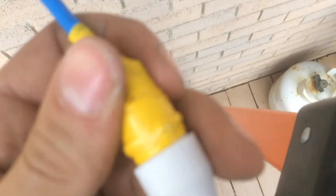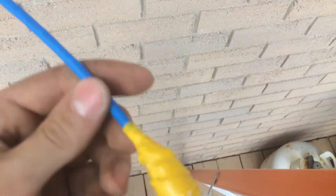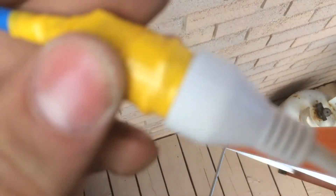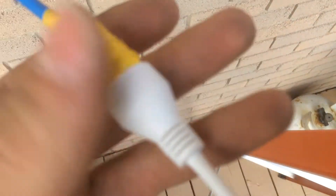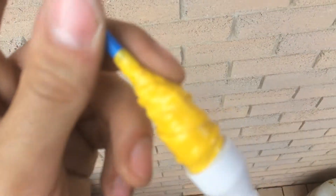Since you're plugging it straight into the NVR you just need your Cat5 cable. If you were going to install it with wiring exposed — like running it along the wall — you would first put your weatherproof boot on the cable before you put your RJ45 on, and then when you click your RJ45 in you would seal the weatherproof boot. In our situation, because we have it going into the soffit, we don't need a weatherproof boot.